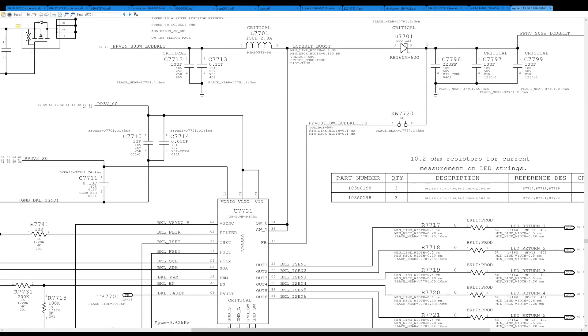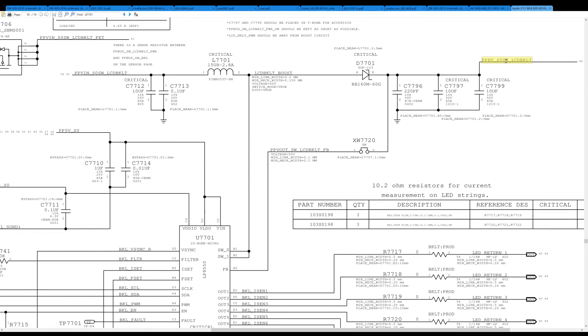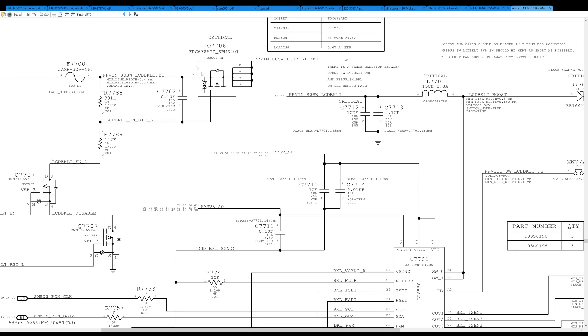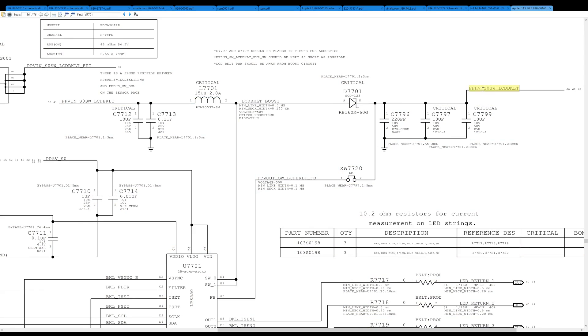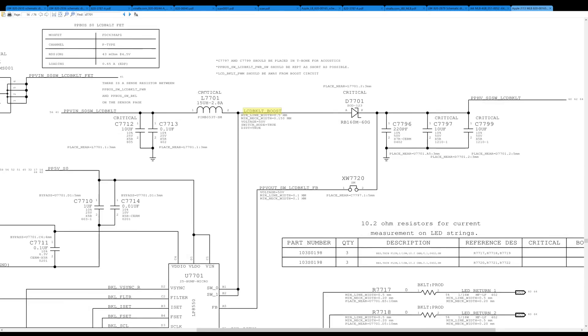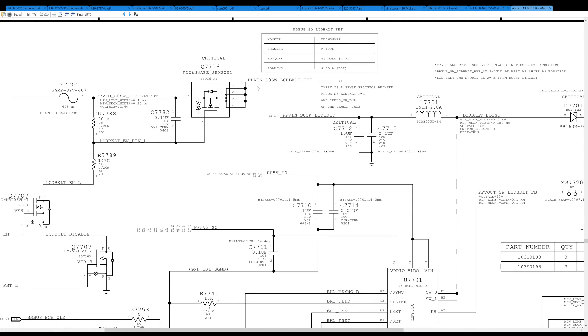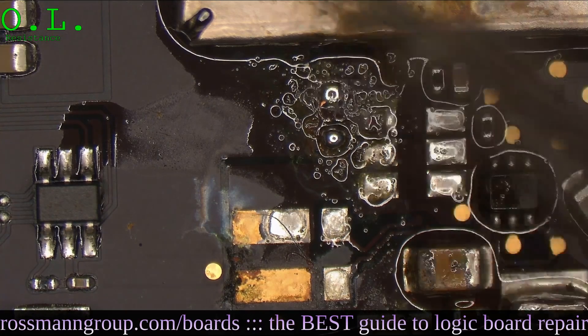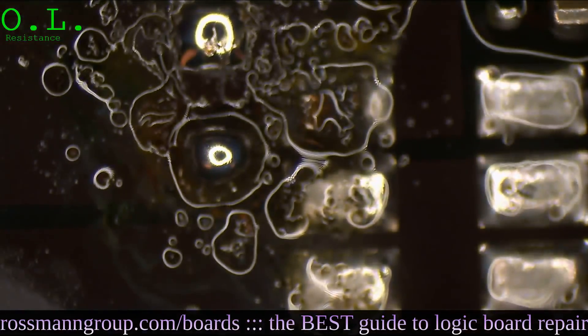We ran the jumper wire for feedback once we saw that the feedback part was damaged. After that was fixed, we turned it on but we still had 0.2 volts of backlight output. 0.2 instead of 8, 20, or 30 means there's likely a break in the line. 0 volts would mean blown fuse or the machine telling the backlight not to turn on, but 0.2 volts is not a valid state. We checked over here — 0.2 volts. Back at the beginning of the circuit: 8.5 volts. Then we narrowed it down — 8.5 volts here, 0.2 volts there. Issue: a break in the line over here. When you look at the board right in that section between the fuse and the MOSFET, bam — easily visible.